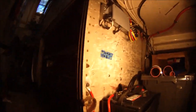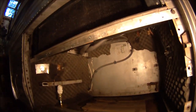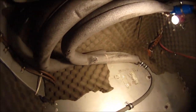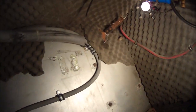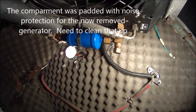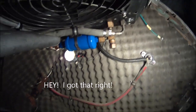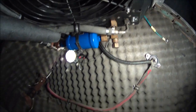When we put the lines in for the air conditioner, I used the original HVAC lines and ran some of the new lines just inside the old ones — I just slid them right through. This is how they come in here, kind of secured along the route. It's made so I can swing this open and look at the sight glass on the dryer — the blue thing is the dryer. I made that loop on there so the lines wouldn't be under stress, and I made it so I really didn't have to open it anymore to charge it.